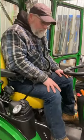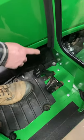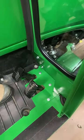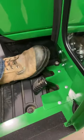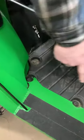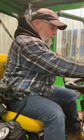There are removable pieces on this side — if you ever wanted to remove your cab, you'd remove those bolted pieces, and that will allow you clearance to lift this cab straight up. Same thing on the other side. I had to create these foot wells because the way the pedals are designed you needed that extra foot room — it's a John Deere thing, because every one is the same. Your tractor cab is mounted with your original bolts: two here and two on the other side, and the main bolting point is in the back.